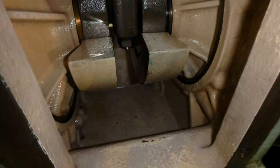Okay, when we have made all the assessments, we go and isolate the power from the power panel. We will depressurize the line. We will empty all the lubricants from the compressor. We will put up a notice that personnel is working. We will inform all the persons who will be part of the work or not. Signs will be attached. And after we remove all the oil, we depressurize the line. We make sure it is 100%, and we always double check in case something goes wrong. But anyway, if you do all the checks, there is no way for something to go wrong.